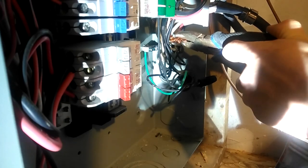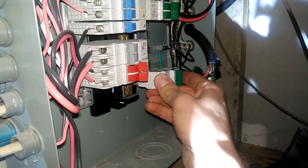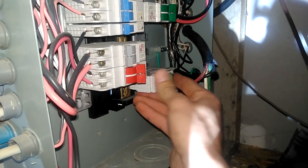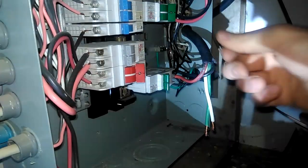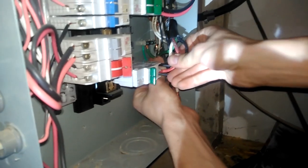Snap the protector over your cable and pull it through carefully — right now my panel is still alive. Snap it in, and the casing should just protrude through your panel box and end there. Now I shut the power off — that's a very important step. You have to shut off power to the whole house; you can't just turn off a breaker. I already had my breaker wired in to minimize downtime of power to the house. It just snaps in place — outside end first, then the inside end, just push it down.